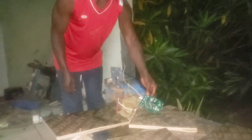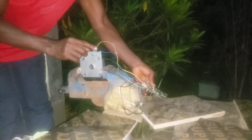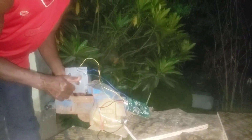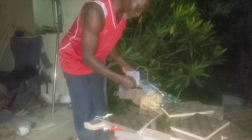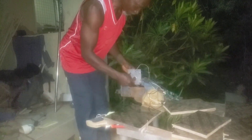Now I'm using this as a generator. This is the bridge rectifier — the panel that came with it. I've extracted it and I'm using it as a bridge rectifier. The DC input is now the output. I've connected a 60-watt buck converter to it. When I use my hand to rotate it with a rope it should give us output as a generator. It's a powerful generator because the winding is a delta winding. If you want to know about delta winding versus star winding, sign up for my online course.